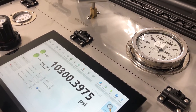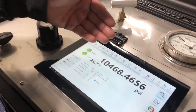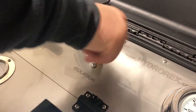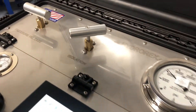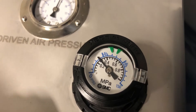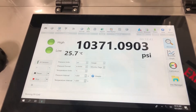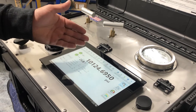Now we're going to close our air valve. Our digital recorder is showing 10,000 PSI. We're going to close our isolation valve as well. In this model, it took roughly 40 PSI of consumed air to reach our 10,000 PSI pressure. We're finishing up our test — after 15 minutes, we're still holding at 10,000 PSI.